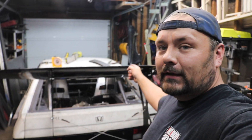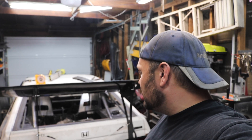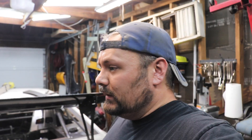Dude, how good is that? I told you it was obnoxious. I don't even know if it's going to fit through the door. I don't know what to say — just look at it. Oh my God, that actually came together pretty good. You don't need a water jet or laser cut parts if you need them in a hurry. Making those brackets did take a couple of days, but that's still faster than plotting it out in CAD or waiting on SendCutSend. A drill, a jigsaw with a metal blade, and a die grinder — you can make your own laser cut part.